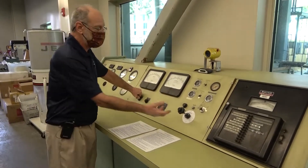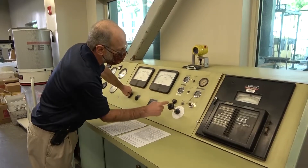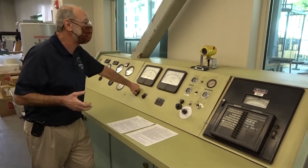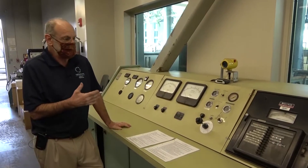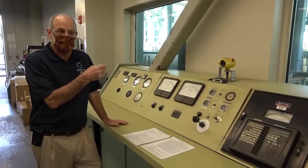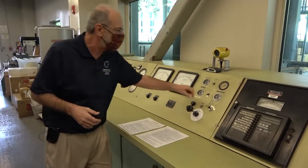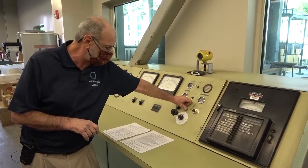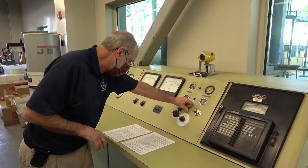We also want to make sure the throttle is in its idle position — unlock it by pushing the button and pull it out forward all the way. Make sure that little blue arrow up top is pointing straight up. Now I'm going to push the heater button. Diesel engines have to operate even when it's cold, and if the engine cylinder is too cold, we might not get a high enough temperature for combustion. So we'll push the heater button for about 20 seconds to warm up the inside of the cylinders. We're in Southern California and it's in the 70s, so we probably don't need it today, but I'll do it as a matter of course.